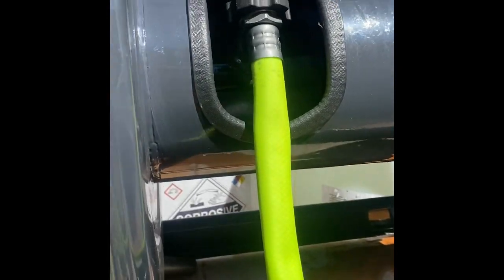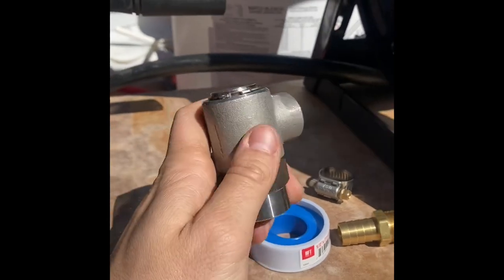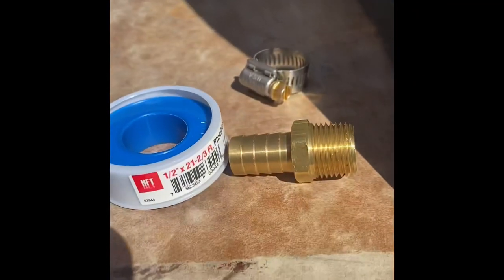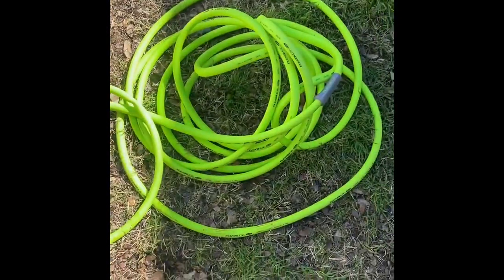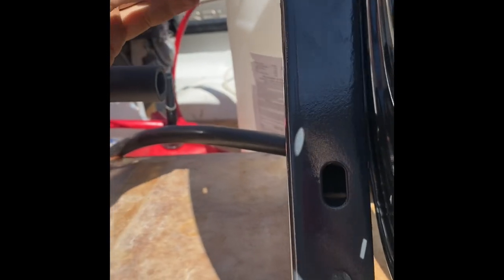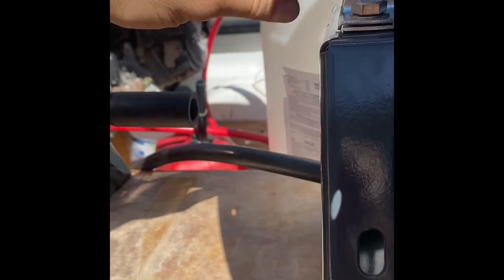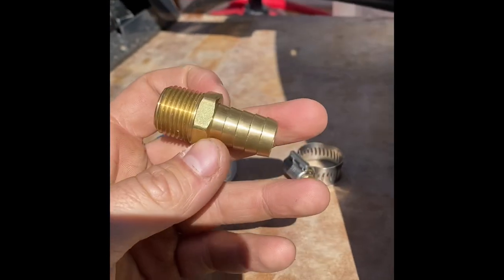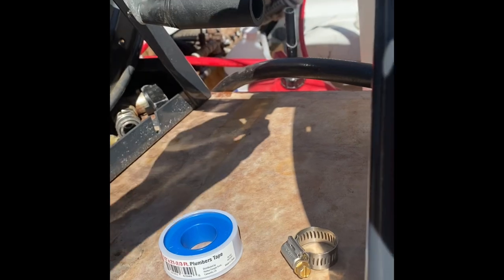The other thing you're going to get when you buy a General Pump hose reel is one of these little 90-degree elbows, which goes right here. This is a half-inch fitting and these are half-inch elbows as well. So what you're going to need is a half-inch to three-quarter or five-eighths barb, depending on what your garden hose is. For instance, my garden hose is a five-eighths Flexzilla. You're going to screw on this elbow that you get with the reel — you'll need some Teflon tape for this — and then screw in the half-inch to five-eighths barb fitting.